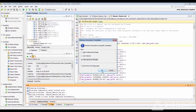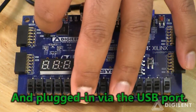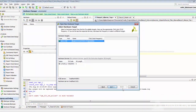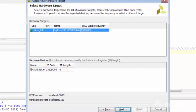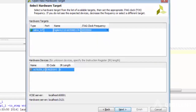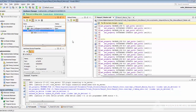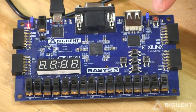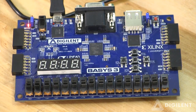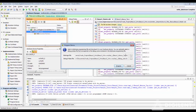Open the Hardware Manager and open a New Hardware Target. Click Next, make sure the device is turned on, and click Next again. You will see the FPGA part number. Change the JTAG clock frequency to 30 MHz, select your device, click Next, then Finish. The device is ready to be programmed. The jumper on the board is set to JTAG programming mode, so you can program the device using the top module bit file.